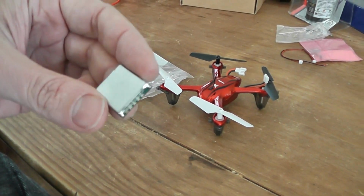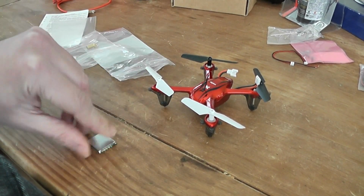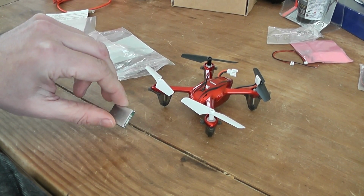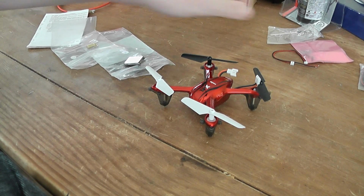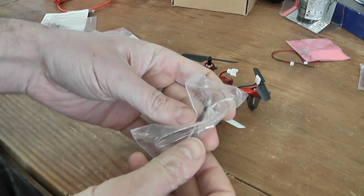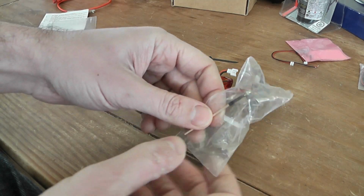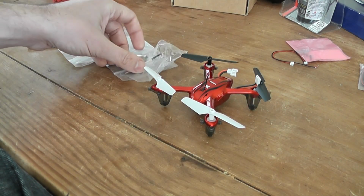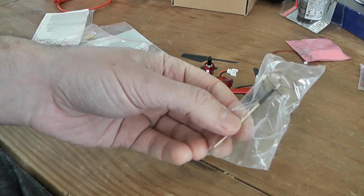So I will need this video transmitter. Okay, it's an efficient working one, if I'm not wrong, not the Boscam one, but more the Fat Shark. I will use this very tiny 5.8 gigahertz cloverleaf antenna. It's coming from FPVOB. Okay, it's very light, it's close to 1 gram, especially if I manage to cut a part of this cable.